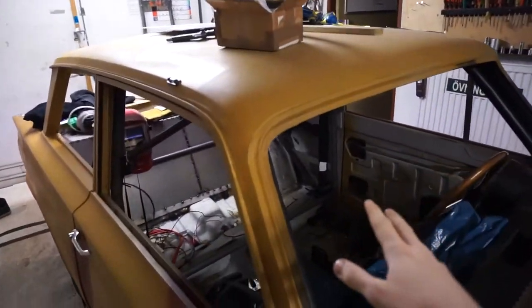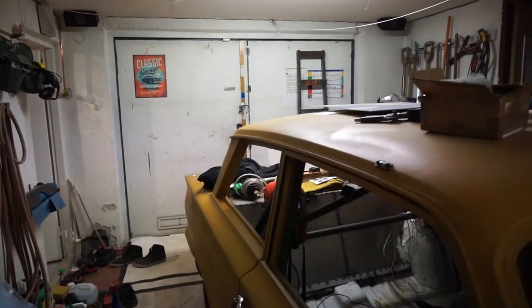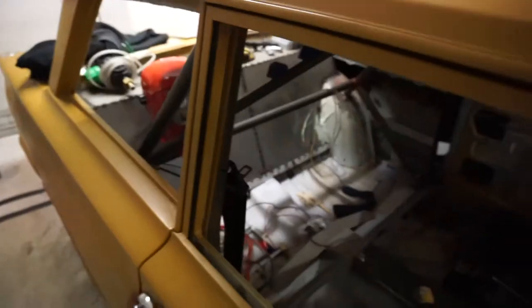So I was going to push the car out and start welding up the plates, but it started raining, so I decided to wait. Now it's unfortunately dark outside, so I'm going to do my best recording and probably use some lights so you can hopefully see something. What we're going to do now is we have these plates made for the corners of the cage — this is going to get welded in, this is the roller part, and the same for the other side. Then we have these small plates that are going to get welded down here for the lower part of the seat belt. We also got to weld in these, but we can't do them right now because we're actually waiting for some sleeves to put into the cage — we want to have the seat belt bolted to the cage so it's all nice and solid. So let's push the car outside and start welding.